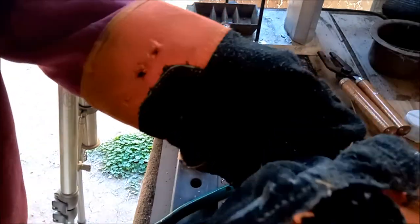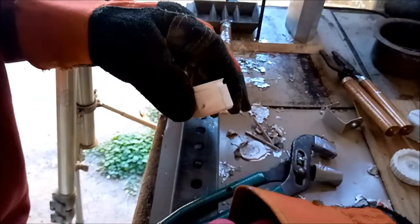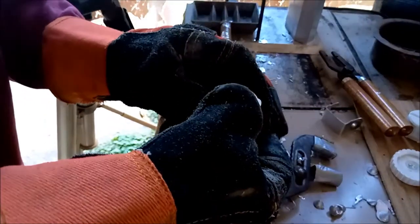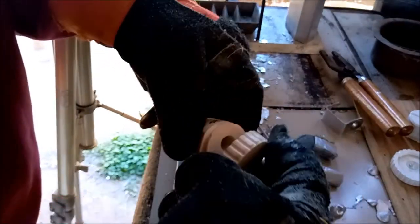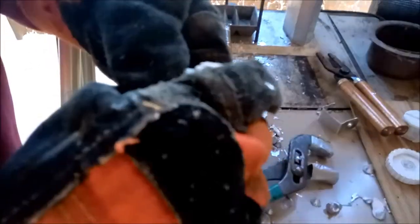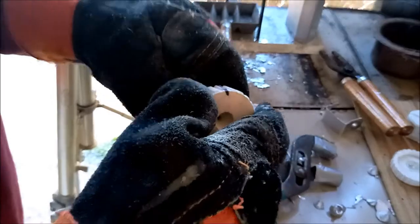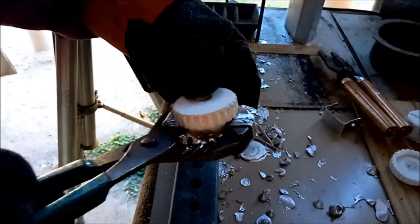I had to make separate hollow point pins for each mold because one was longer than the other one. And I thought if I wrapped some duct tape around the underside of the one, it would be enough, but apparently it was not. So the mouths of the hollow points may not look perfect on these, but I don't really care. I just want them to cast well.